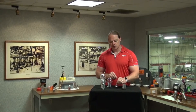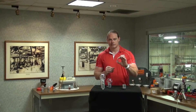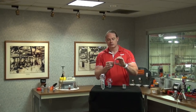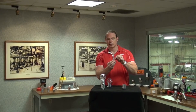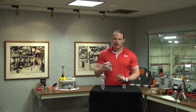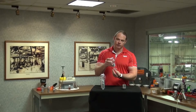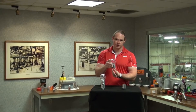To begin, open your Optomatic Oiler and take the level adjuster assembly — there are two wing nuts on here. Be sure to set your wing nuts together tightly at the level at which you would like to set the oil level in your bearing housing. The upper casting and bottle assembly of the Optomatic Oiler is going to rest on this level adjuster assembly.